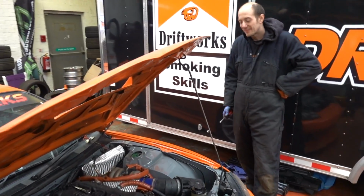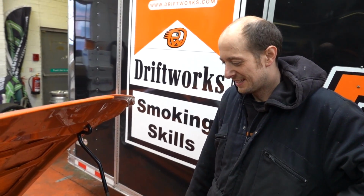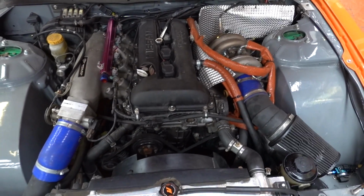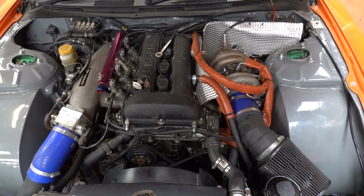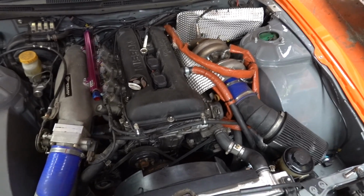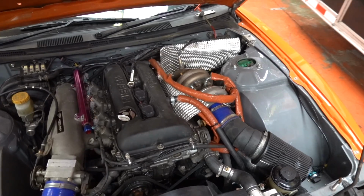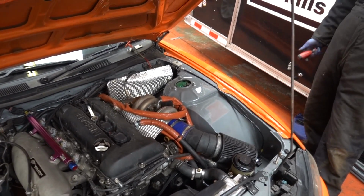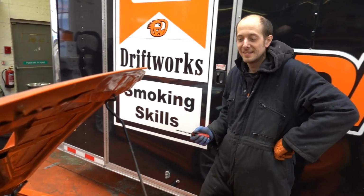What have you just been doing for me? Turbo manifold gasket, as you have to get used to if you want to use an SR20. This has actually not been touched since my last Rockingham practice day, where the turbo almost literally fell off. At least it didn't rattle the bottom end. Well, it might not have. We haven't started it yet. Oh yeah, fair point. So I basically just took out the gasket completely, bolted it together face to face, but I kept having to tighten it up every time I came in. So I've just got an actual gasket put back in by the professional mechanic Jay.